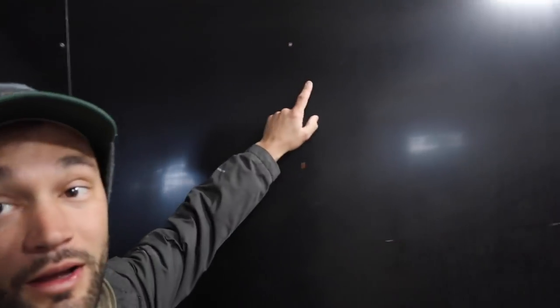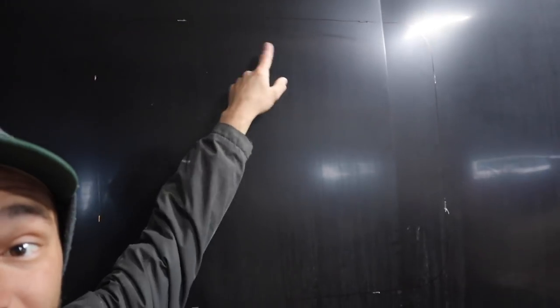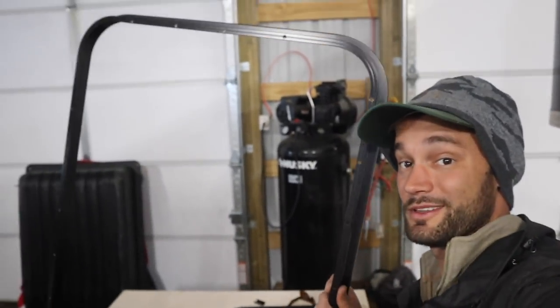We've got our window completely marked out. You can kind of see the outline a little bit, but now Jimmy's going to be cutting out this hole. It's marked to the exact dimensions of the actual window frame that we'll be installing, and once we have that hole cut, then we can get the window placed in and dry fit, make sure everything's nice and snug, and then we can move on to the second window. So definitely a bit of cutting today — precision cutting — but I think it's going to go fast once we actually get it going. Safety third.